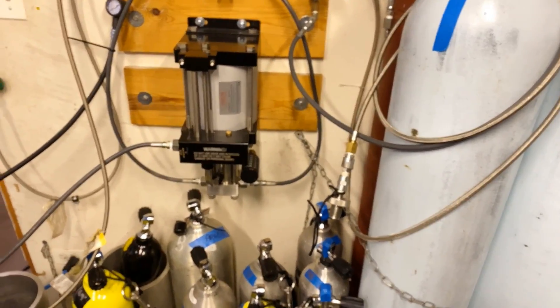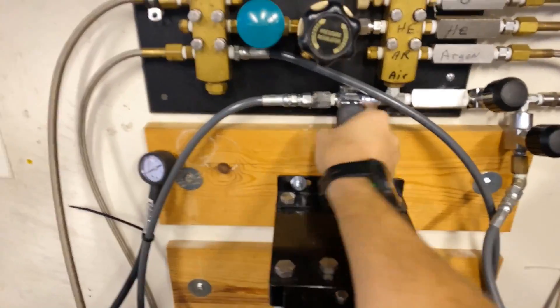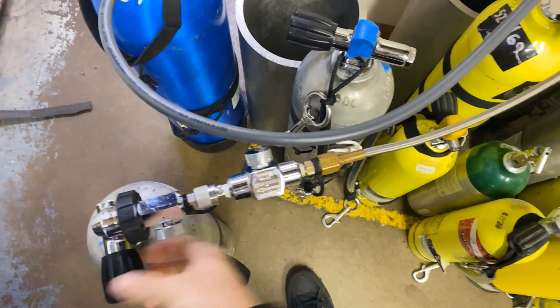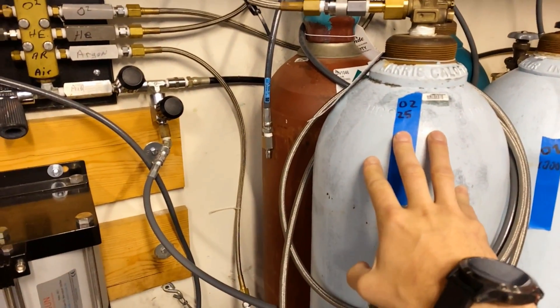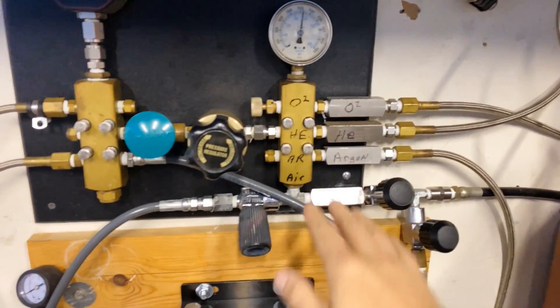Let's take you through the whole setup. If I'm going to fill a cylinder, I first want to see what we're at, so I'm confirming everything is closed on my manifold system — it's nice to start closed. Pressure gauges on, then I'll go to my cylinder. The bleeder is closed. Now we'll pressurize and open. This cylinder of O2 is at 1325, and this other cylinder of O2 is at 2500 PSI.